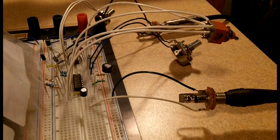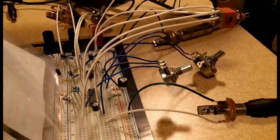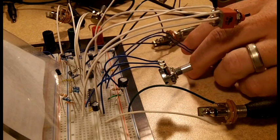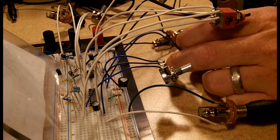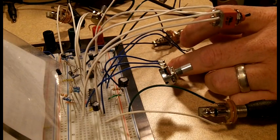And that's the stock circuit right there — the Penfold Fuzz Unit. For fun, I made a few changes to the circuit. For starters, I took the fuzz out — well, I left it there but it's disconnected, so this knob doesn't do anything. I basically put in a send and a return, an effects loop that I can plug an external pedal into instead of the fuzz.